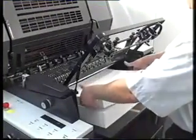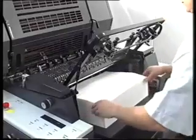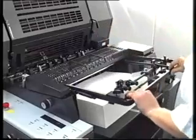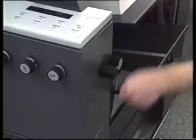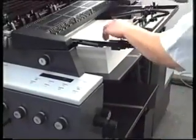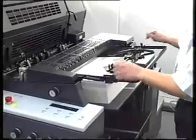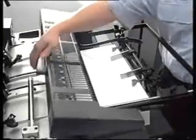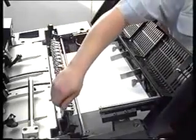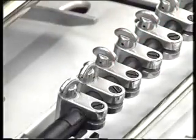After loosening up and loading the paper, swing down the frame together with the rear sheet stops and rear edge blower. Move the pile table upward and position the rear stop against the rear edge of the paper so that it just contacts it. Secure the rear sheet stop using the 2 thumb screws. With smaller paper sizes, the suckers outside the paper format must be disengaged. This is done by turning them around 90 degrees.